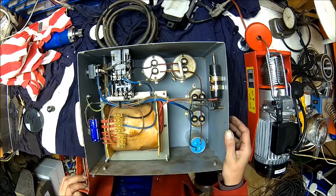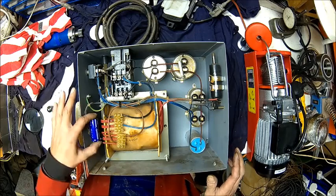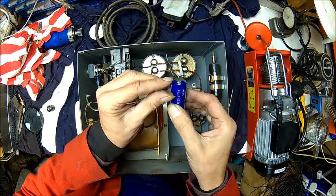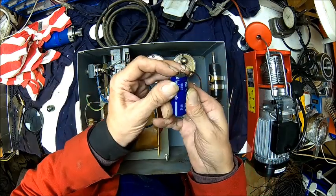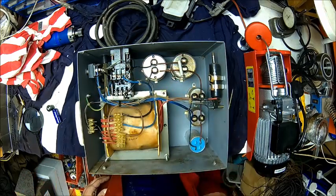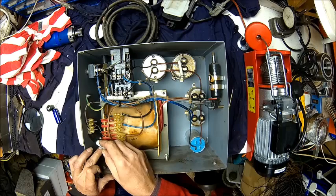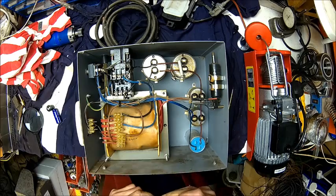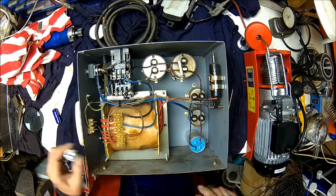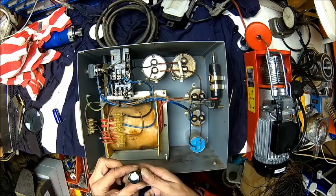Can't be much wrong but we need to fix that capacitor because it looks like it's blown out. Let's take that off and put a new one on and we'll see what we get. You can see it's pretty blown - it's pretty bulged. Let's put some notes on here, make a plus mark. So we know there's a rectifier down here. Let me solder on these wires and we'll come back. It looks really small for that size, but whatever - that's what it is.